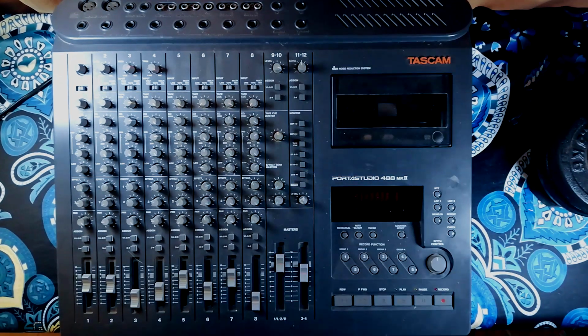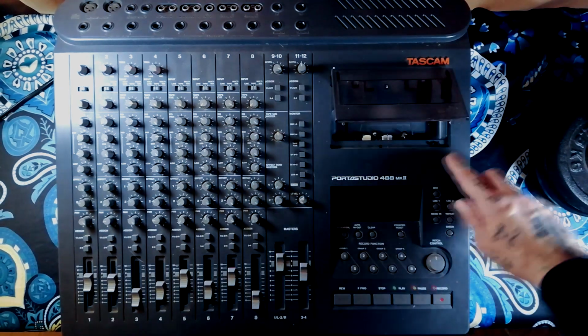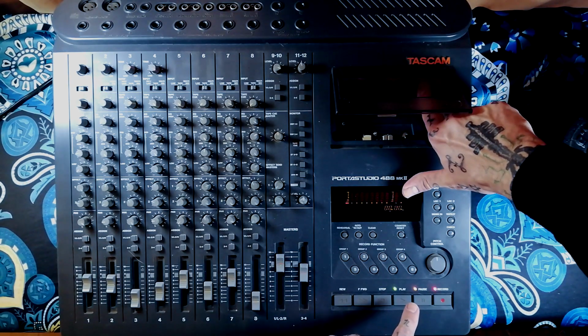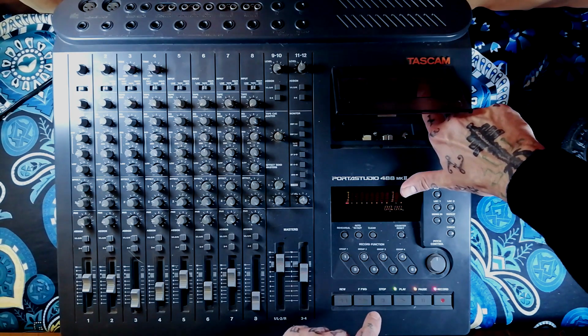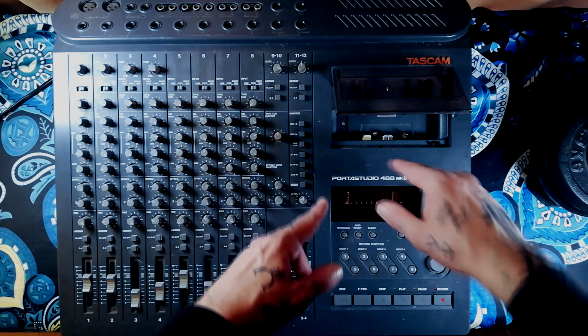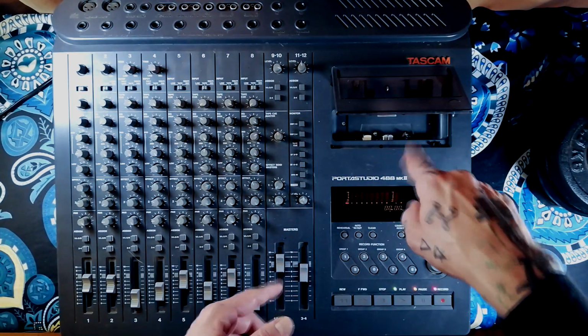So let me demonstrate. Hear that buzzing? And you see these three are flashing. Then if I push up on the right hand switch on top there, which would normally be depressed if a cassette was inside there, and then try and press these transport buttons, you can hear it whirring, thinking about it, but it's not really working. And when I removed my finger from that switch, then there was whirring again, because gears are trying to turn to retract and lower this head assembly, but it can't do it because the gear C is broken.